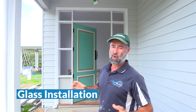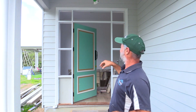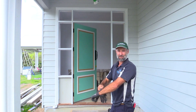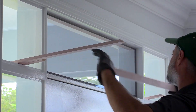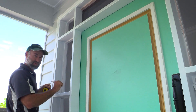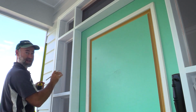Now that we've moved into the house, I'm doing all the odds and ends. One of the final things is putting glass around these sidelights and highlights — you might remember from earlier when we custom-made this door. The guys have painted it and I'm going to silicon the glass in. Not having those in place meant wasps and bugs coming in while we were living there. The glass was made up locally at a little local glass place. Before I put the outside glass on, I'm cutting the little glazing beads — like little fillets. I'll chop those up on the drop saw, then slide the glass in, put the fillets around, nail it off and it's done.